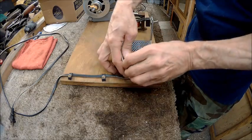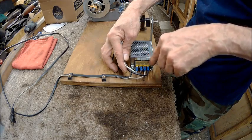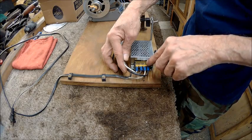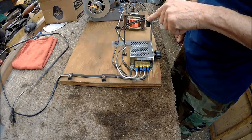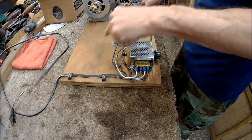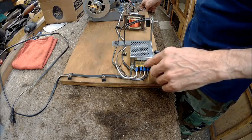Now we'll lift this up. This comes in - the white comes in to the input. On the input you've got two input lugs and you've got two output lugs. You put the white to the input lug, and then the black wire is going to go to one side of your switch, then you're going to have a wire that goes from the switch, on the other side of the switch, back to the input on the control box. So now you've got both your inputs hooked up.